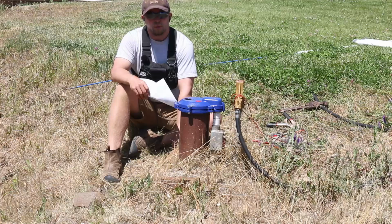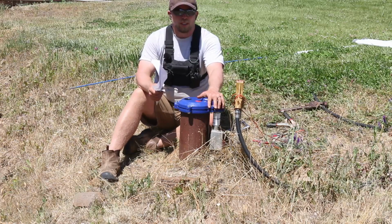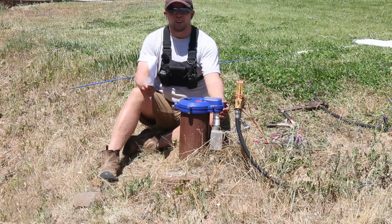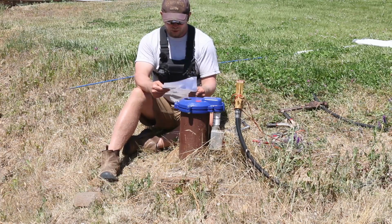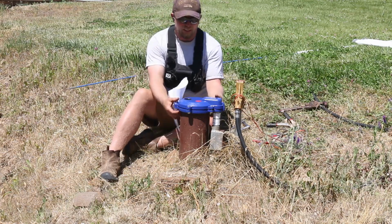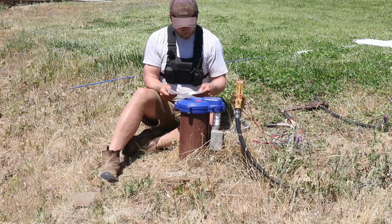And so far, it's been a few hours actually. And the problem, why it's been so long, isn't the instructions. It wasn't setting the new well cap on here, which is what we have. It was getting the darn old PVC threaded pipe off. I ended up having to cut it where the electrical went through and put a new one in. That thing was on there, and I was trying really hard not to have it break, but there's just no way. So I finally had to go. Ended up actually fabricating one.